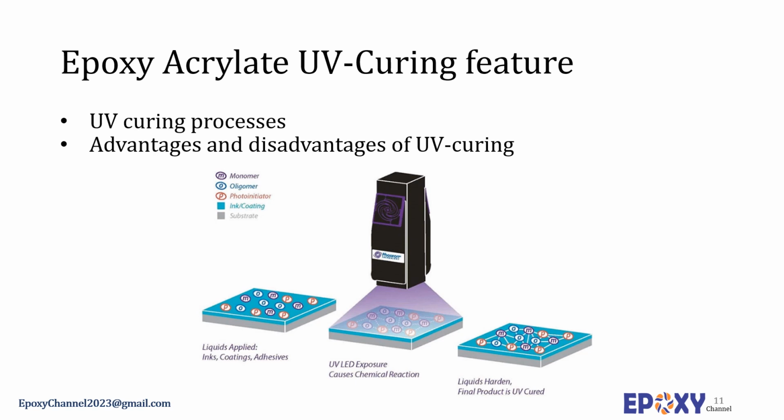Cationic photopolymerization is an alternative polymerization method in the production of cured coatings. The cationic process is not inhibited by oxygen, however. Compared to the free radical photopolymerization, it does not stop immediately after the radiation is turned off, but occurs in darkness, sometimes slower, which is referred to as dark curing. Curing coatings with cationic photopolymerization are often used for monomers that cannot be photopolymerized in a free radical manner, for example, vinyl ethers and epoxides.